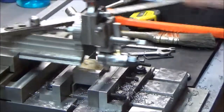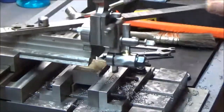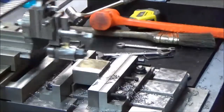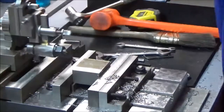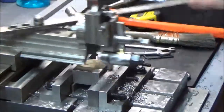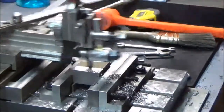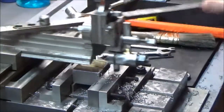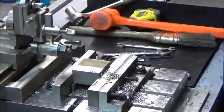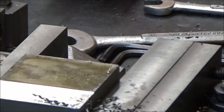I want to show you — it's just cutting like glass, smooth as glass. I ground the bit at 45 degrees. When I had it cutting at a flatter angle, I had little chatter marks, and I still have those to some extent but they're almost not noticeable. The 45 is really working nicely, and I can just grind it corner to corner. I'm going to zoom in on the cut so you can see the chips coming off.